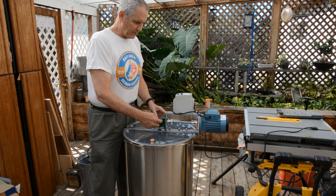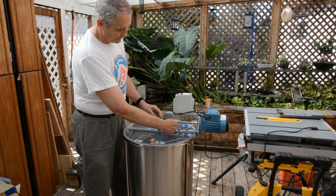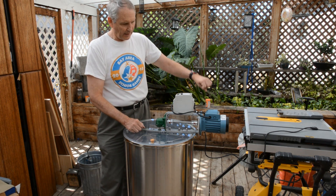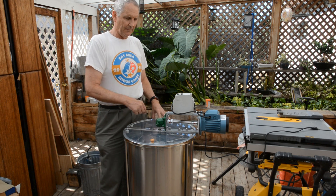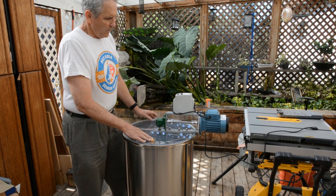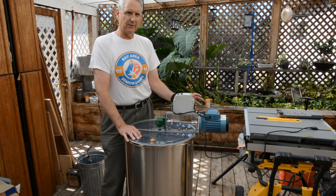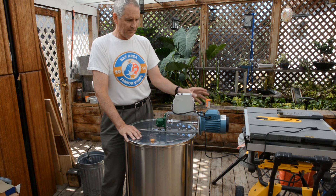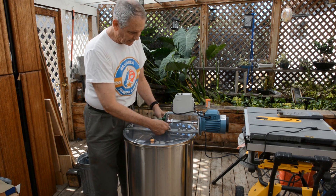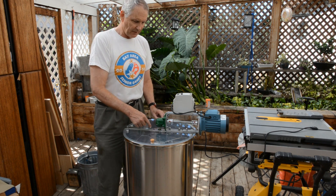Originally on this unit, the angle head was facing the opposite way, with the shaft going down. This is a 2.5 to 1 reduction, so every one turn of the handle, the basket turns 2.5 times — you don't have to turn the handle very fast to make the barrel turn fast. The problem is this electric motor doesn't go that slow; it needs to turn maybe 50 RPM to even get going. So I had to flip it the other way and made this bracket, so now every 2.5 turns of this shaft turns the basket one time.